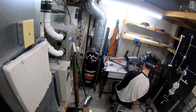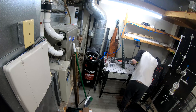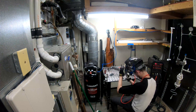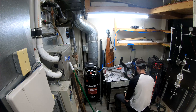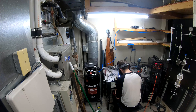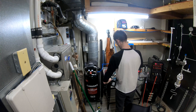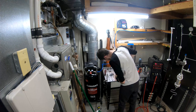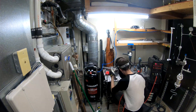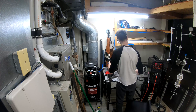I'm still kind of getting the whole shop built up. It's really exciting to be able to just do a project like this and have enough stock and tools to take it on. Here I'm welding the last eight nuts onto the launch pad frame so that I can attach all the legs with the screws and then move on to building the strong back for the launch rail itself. Welding these nuts on was a pretty finicky process just because the risk was melting the threads and making it impossible to remove the bolt. I did weld these in place with the bolt screwed in from the front side, so if I welded it to the bolt, I had to angle grind both the bolt head off and then the damaged nut off. Once I had all those welded in, I chased the nuts themselves with a tap just to clean up the threads so it was really easy to thread in and out, and I'm just power tapping all of these, so it went real fast.